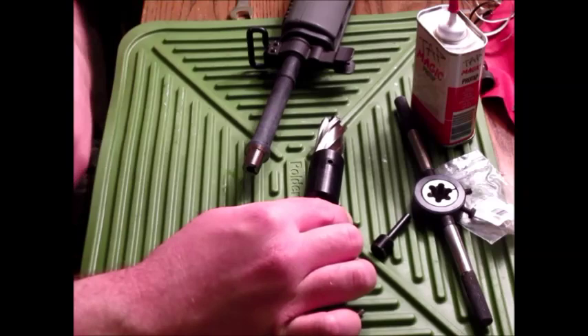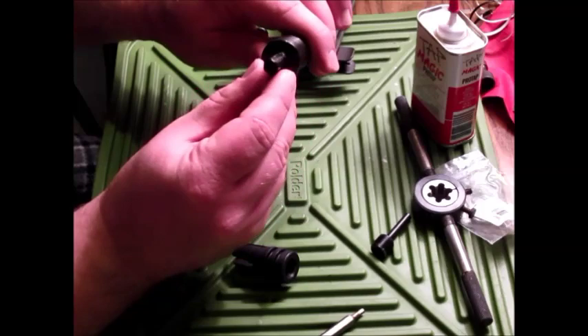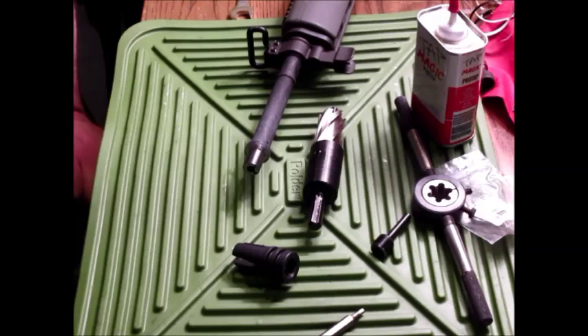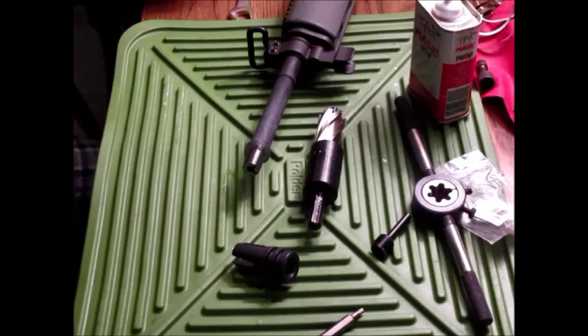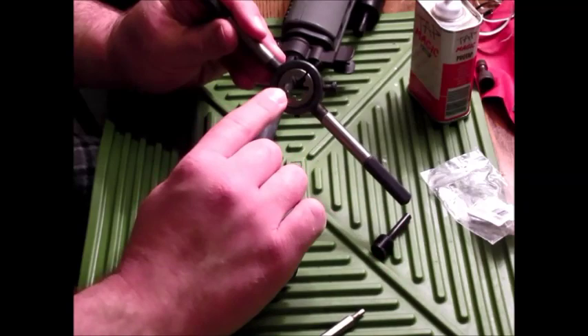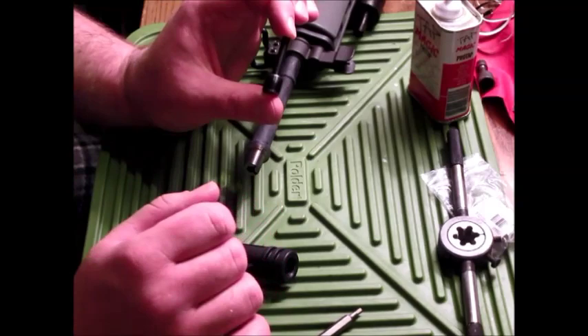I was using a half inch D-handle drill. As long as you're turning it slowly, I don't know if the power or the chuck matters. This has obviously got flats cut onto it for use in a drill. Like you saw, it was just a matter of going slowly, keeping it well oiled — I was using Tap Magic; any sort of high sulfur cutting oil should do — then clearing the chips just with a toothbrush. To actually cut the threads themselves, I was using a one-inch wide split ring die with half inch by 28 threads.